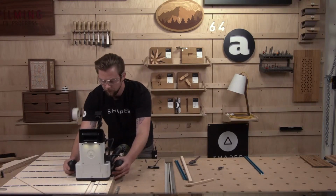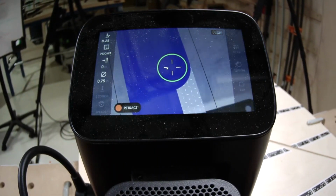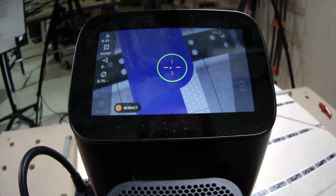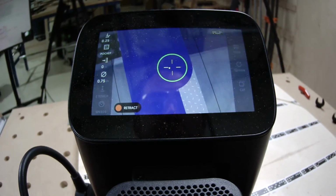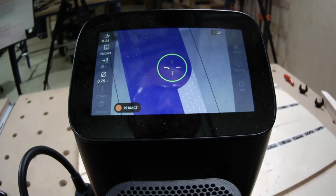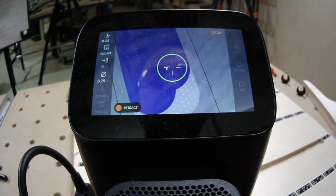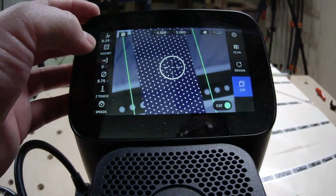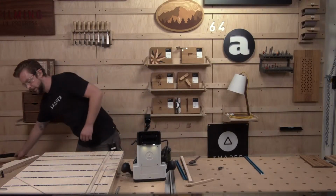I think the maximum that I've ever done is an 8mm cutter at an 8mm depth of cut, which is pretty chunky. So this is definitely a big cut here, but it looks like Jake's handling it pretty well, coming around to the back end of that pocketing cut here. And we're pocketing because it leaves a really nice roughing offset already baked into the pocket, so that when you come back in for your inside cut, you're taking off way less material, and it's a much smoother cut. Yeah, let's see how that looks. Get some of this dust out of the way.